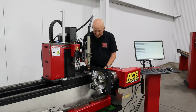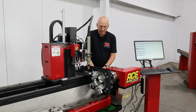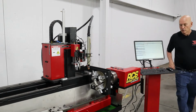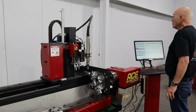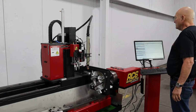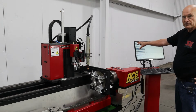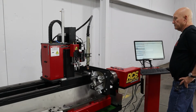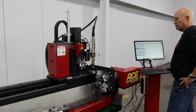I place it back in the machine. I'm even going to place it back into the same hole because it really doesn't matter. Now I can come back over here and run it back a little bit further. Oh, I'm sorry, we got to rehome that axis because we just changed it, right? So we're going to go to the home icon up in the top left of the screen, and I am going to select home Y. It's asking me, do you know that there's a lifter in this machine? If so, make sure there's no material in it.